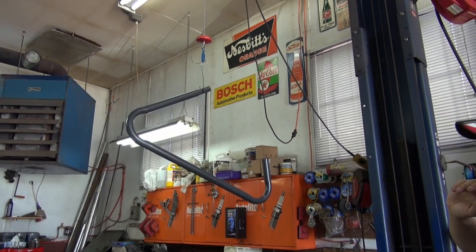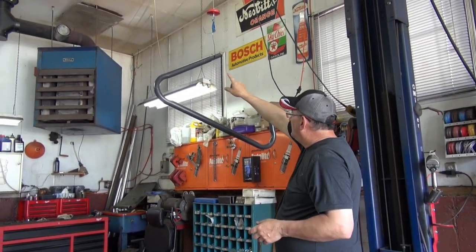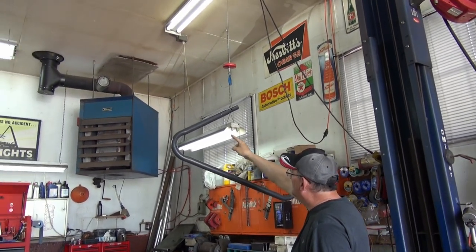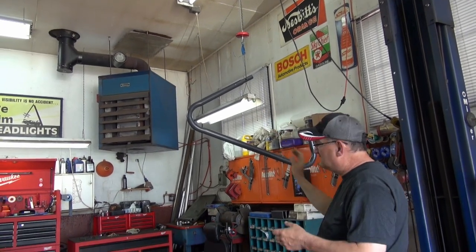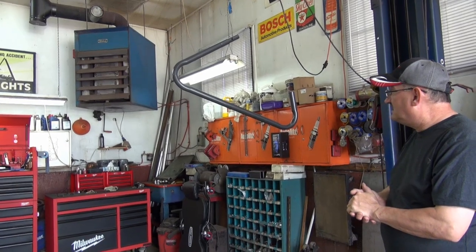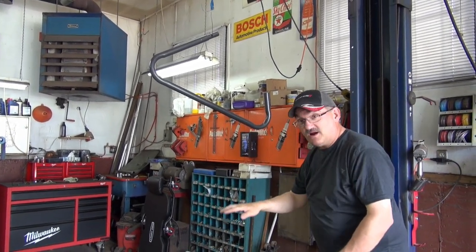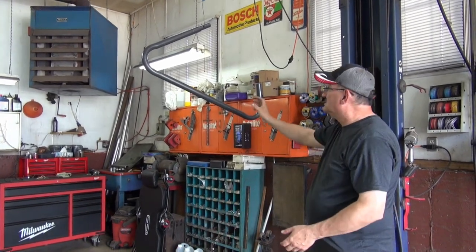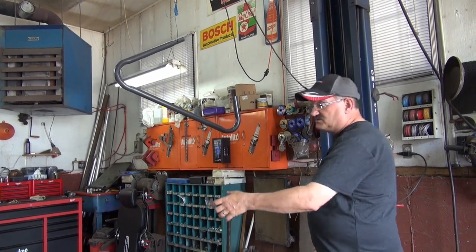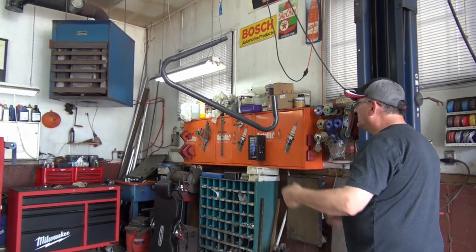Before we sign off on this video, we'll show them. So this now will go down in that pipe. See, I had to machine a piece of pipe to go in this pipe and index it. So this could act the exact same way. And also, providing this is going to clear the top part of the thing when it swings over. If it doesn't, they just pull this out and leave it out. But at least now, the poor person who's having trouble getting up over these steps will be able to grab that rail and walk right up.